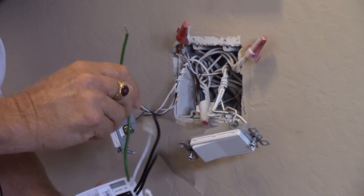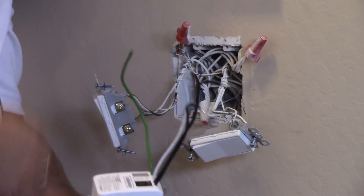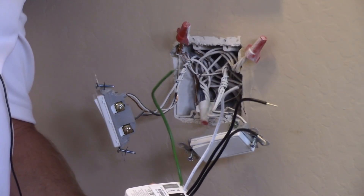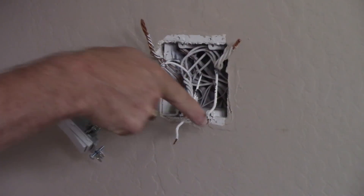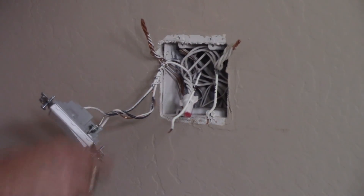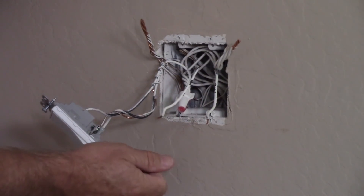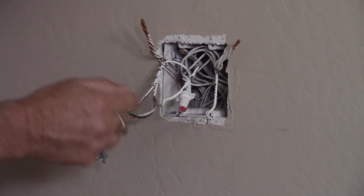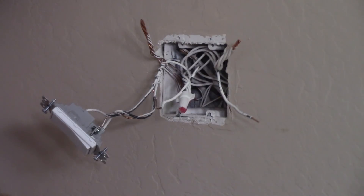We're going to remove the old pigtail, tie the ground right into the ground splice, the neutral right into the neutral splice, and make two new splices for the hot wires — one hot and one load — that were previously on terminals of the old light switch. Now I've got the wires all prepared. This is the hot wire — should be black but it's painted white. And this is the load wire. You can tell which is which because there's a multiple splice with two pigtails coming out — that's continuous power. The two pigtails go to each switch, so you know that's the hot wire. The wire all by itself heading out on a two-wire cable is the load to the light. I've got neutral exposed and ground exposed, and I've gotten rid of the little pigtail jumper that was coming from the ground splice to the switch.